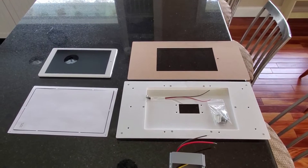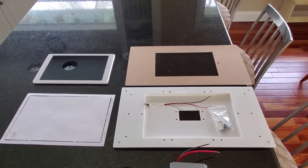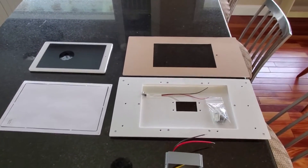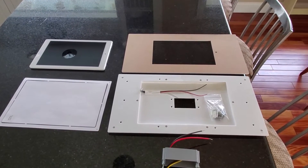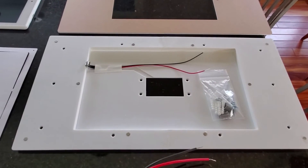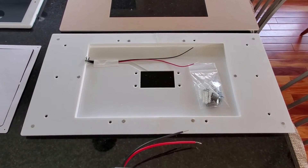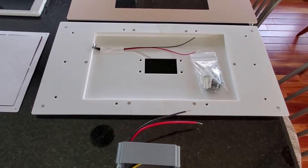This is the wall mount kit to mount the Fire HD tablet into the wall. I worked with Mike Begala of MB Mounts — Makes by Mike — on this custom piece to fill our oversized hole. He offers two options: a surface mount kit and a flush mount kit. This is the flush mount kit, customized to be extra wide. The hole left behind was about 16 inches wide, so I had him create the mounting plate at about 16 and a half inches to give good overlap on the raw drywall edges — no drywall repairs needed.